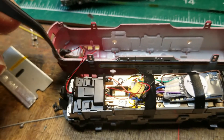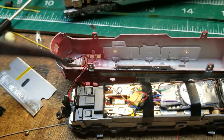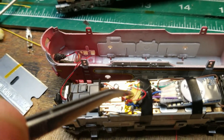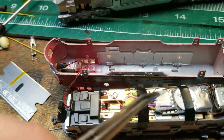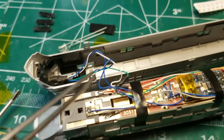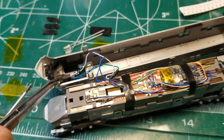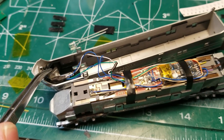This one has 0402 golden white LEDs that have been worked in here, and then they go to a resistor bank, and then they go to your white — which would be your forward — and then your green, which would be your AUX1. Over here I'm just using scrap boards from leftover DCC projects because I've got a lot of them and there's more space to work with in there.